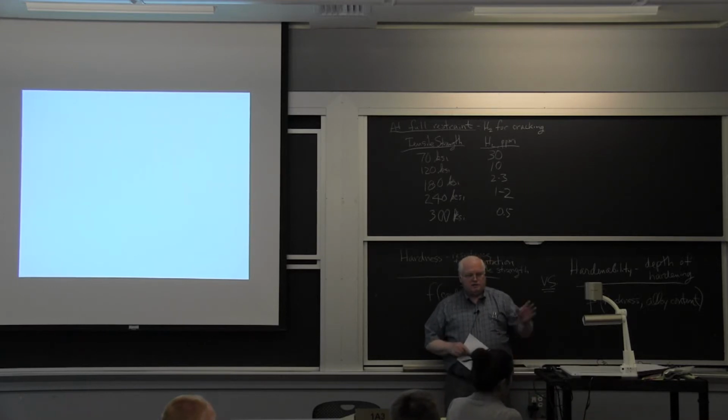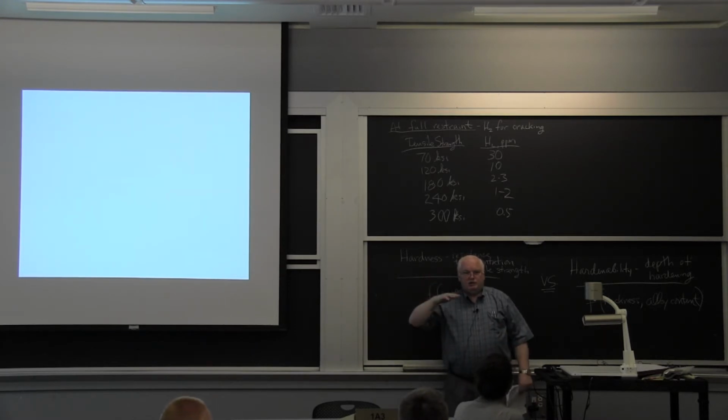When we get to stainless steels, I'll tell you which type it is, but it's a martensitic stainless steel, and you can heat that up and harden it, and you can just take it out of the furnace and let it cool in the air, and it will harden. It's called an air hardening steel. In fact, the only way to get that annealed if you heat it up is to leave it in the furnace and bring the furnace down very slow, over 10 hours or 5 hours or something.